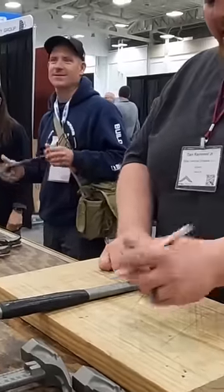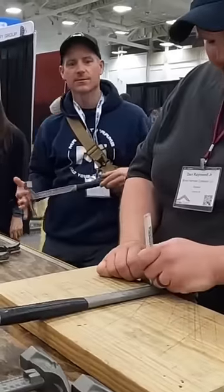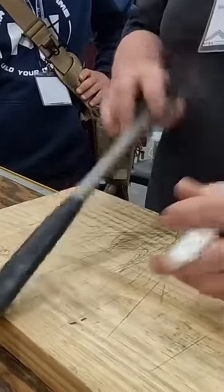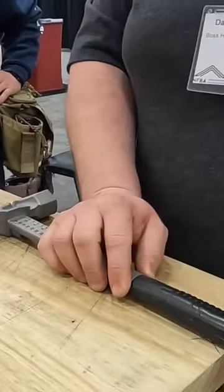That's a 90 degree angle all the way across a 2x12. If I mark right here, that's an inch and a half wide, so if I'm sliding over, I mark that — that's my stud pocket for my layout. This is 16 inches end to end, so if I buck that up against that line and mark this, there's my 16 inch center mark.